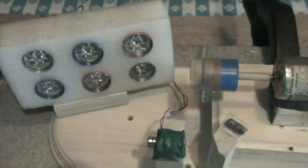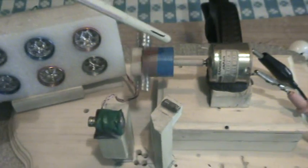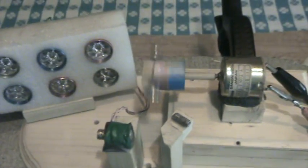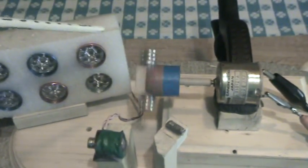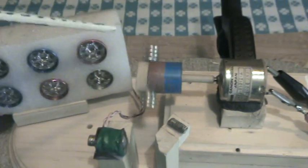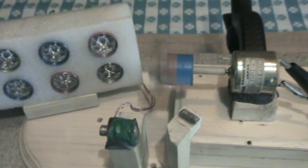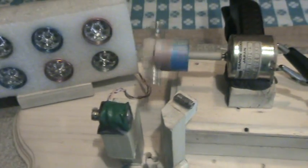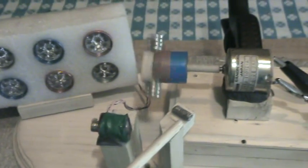I have a one-by-one neo magnet with a hole in it so you can put it onto the wooden dowel rod. It has four eighth-by-half-inch neos on each side. I have an 80 ohm coil, and this will be my activator that vibrates the shaft.